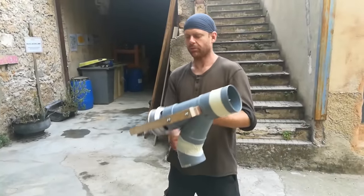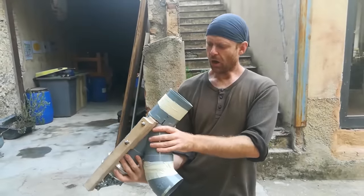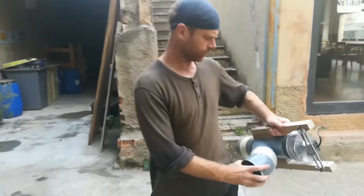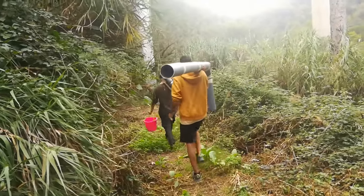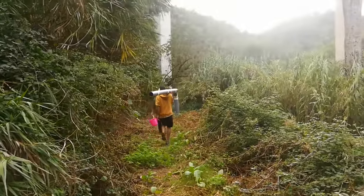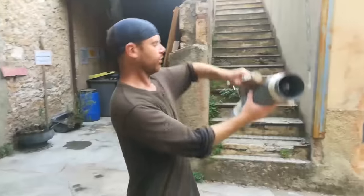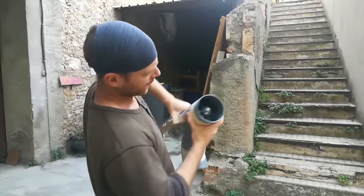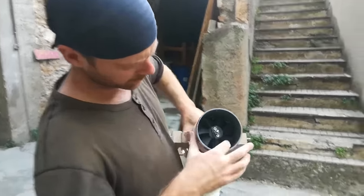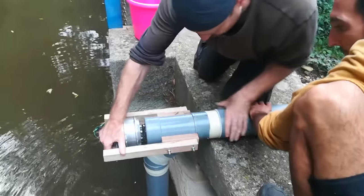This is the phase 3 turbine. It's similar to the previous ones that we tested. I am going to flip it around direction wise though, so that the water is going to come in from here. So we're going to move it further down the canal with about a 2.2 meter drop instead of the 0.9 meter drop, which should give about three and a half times as much power overall. So the water's going to come up here, go across the top of the weir, and then vertically down. This is going to be horizontal, and then the water's going to come out this way and turn the fan in that direction, and then the pipe's going to plug in here on the floor. Other than that, it's basically the same.